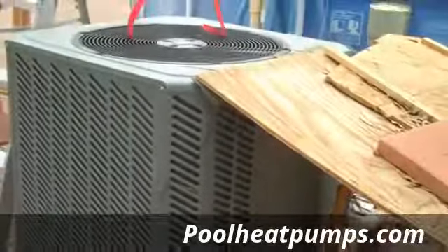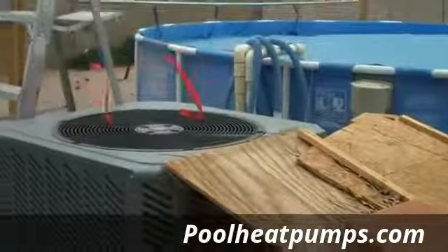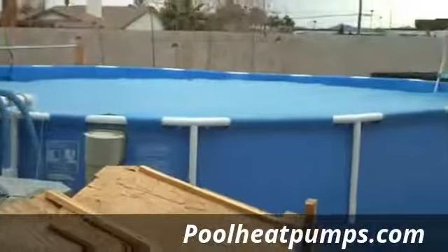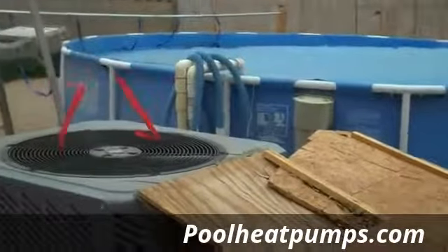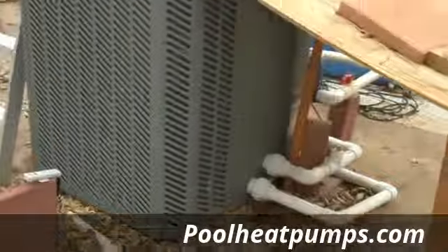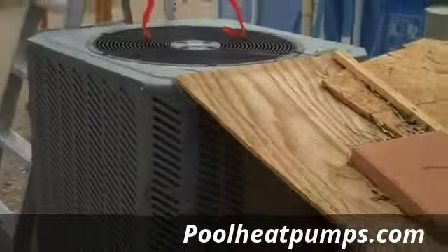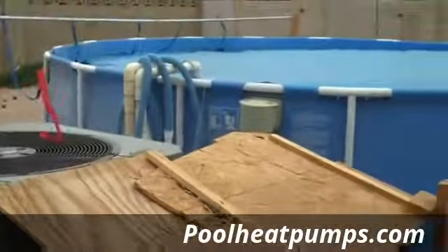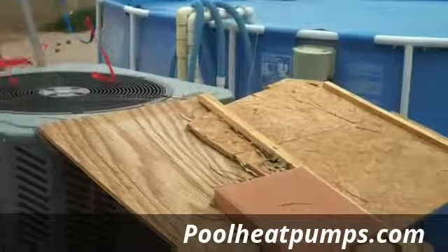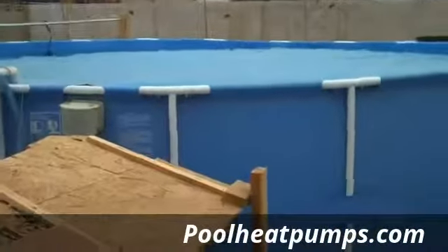There are a lot of misconceptions in the industry — with pool builders, retailers, pool store workers, and service departments who sell heat pumps, gas heaters, and propane. Most customers we encounter out here in the desert southwest — all over New Mexico, Arizona, Nevada, California — are told that heat pumps don't work out here and that you need a big powerful gas heater for wintertime. They say it's just too cold to extract enough heat from the air. Well, this is proof of how well it actually works. This 104,000 BTU unit would work wonderfully in these climates even through the entire winter on a pool up to 20,000 to 25,000 gallons, especially if you put the blanket on it at night.